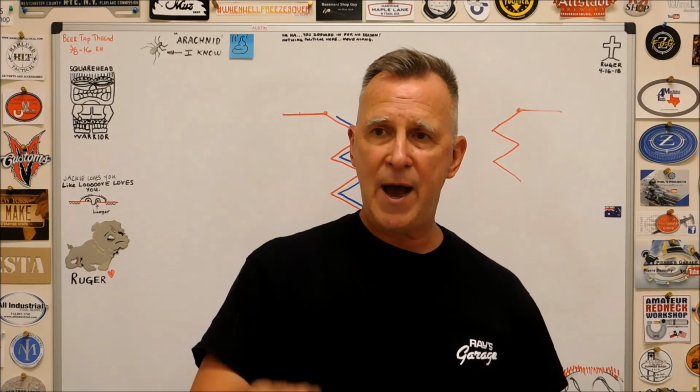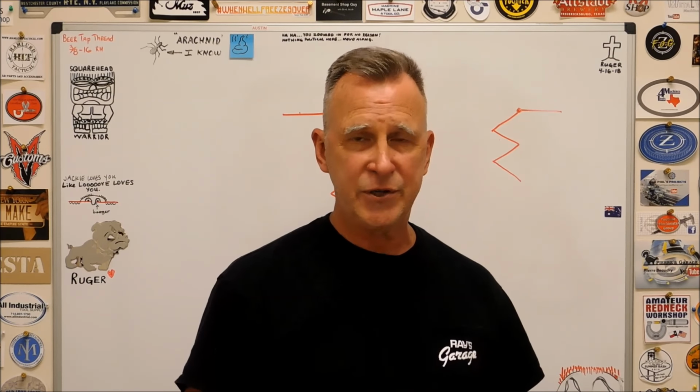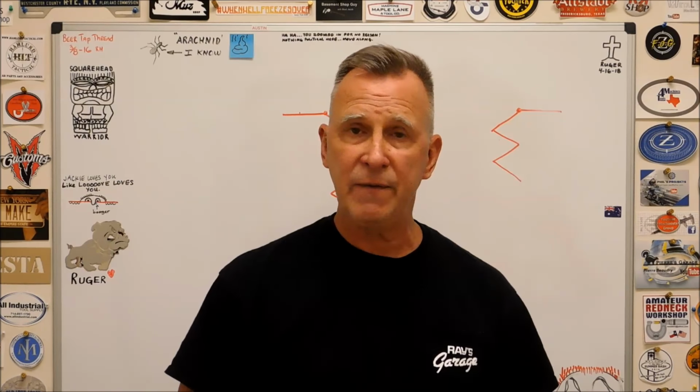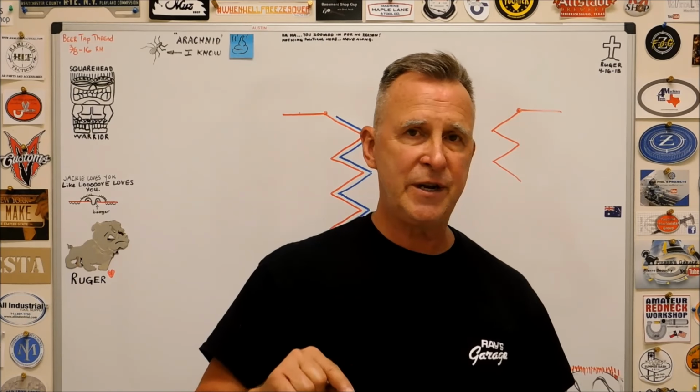The way I do it, I punch the center out, I drill the center out of the screw, completely drill the center out of the screw, and create a spring down inside of the hole. And it works really well. If you can't get it out with a punch, this is the next best thing.